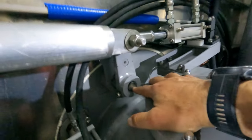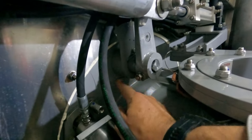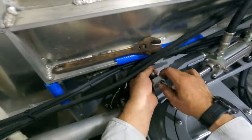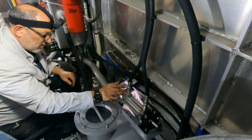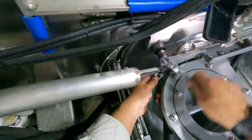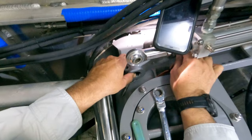Okay, so we're down in the engine with Smoky Point and I'm going to start taking apart the steering linkage so I can get that steering shaft out and replace the seal in there — that's part of the 1,000-hour maintenance package. Here it is right here. There's the shaft there and I've got to pull it out. I've got to take the steering components apart here. The seal is back in this little housing, I believe. So we're going to figure that out together. I need a kid to yell at to hold my light for me. This is a 17mm. I don't know who invented these ratcheting wrenches, but they deserve a raise.